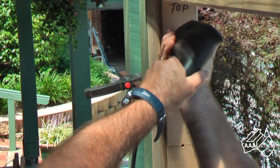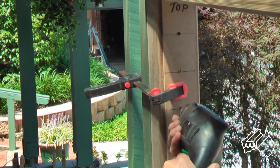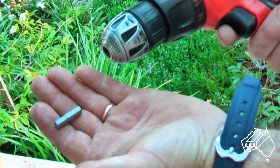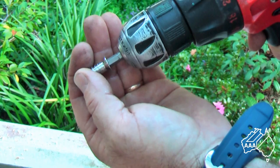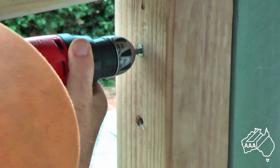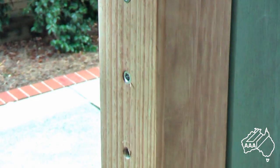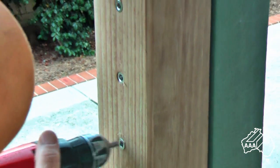Having clamped your drilling template onto your post, drill an 8.5mm hole that is 40mm deep. A handy tip is to put a piece of tape on the drill — this lets you know that you have drilled to the correct depth each time. Next, place the 6mm hex driver bit in a slow rotating drill and proceed to screw in the countersunk timber inserts. Remember that the drill must rotate clockwise for the right hand threaded inserts and anti-clockwise for the left hand threaded inserts. The face of the countersunk timber insert should finish flush with the timber post.